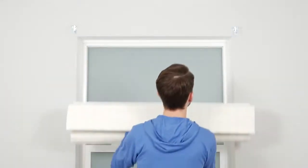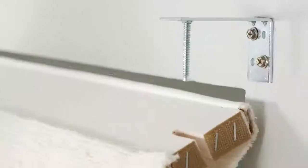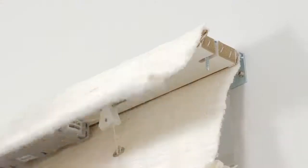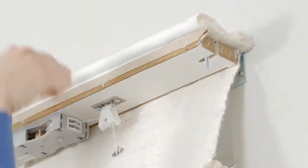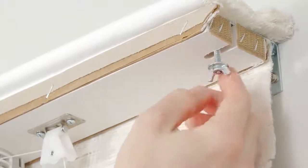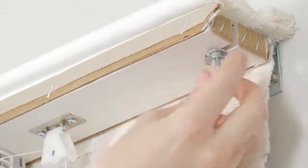Let's put up the shade. With the front of the shade facing you, use the slot holes as a guide to position the headrail over the bottom of the drop bolts. With one hand, pull the valance up above the headrail to expose the bottom of the bolts. Reach up under the shade and attach the wing nuts to secure the headrail to the window.